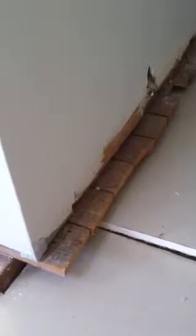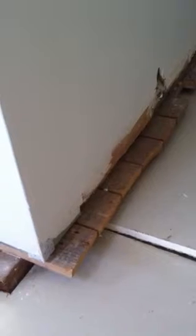We'll add sister floor joists right here and build it out so it will support the floor. What you see right here is the cutoff subfloor, so I'm going to leave that for the time being.